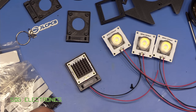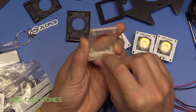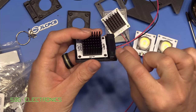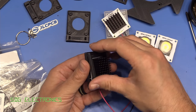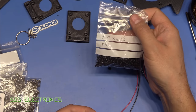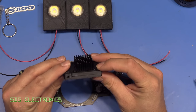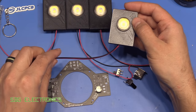The way these LED assemblies work is that in the LED holder there's a hole for the lens and a little slot going all the way through to the bottom edge. With the wire soldered onto the LED side, you poke the wires through the hole then push the lens through. You can see how it's been done - the wires come up underneath the PCB and are soldered through on that side. Then you put the little cover over the heatsink, which holds everything together, and there's a self-tapping screw - 2.9 by 6.5 millimeters - one in each corner going through into the 3D printed material. That's the LEDs fitted into the LED mounts with the four self-tapping screws, and then those need to be routed within the chassis.